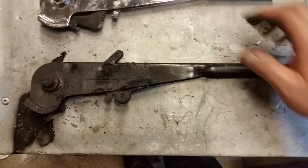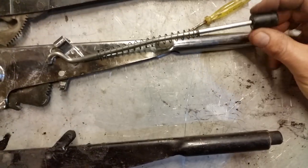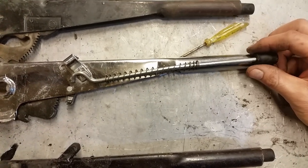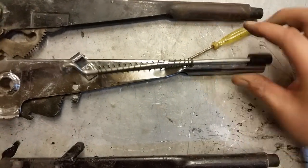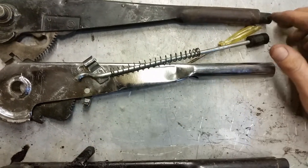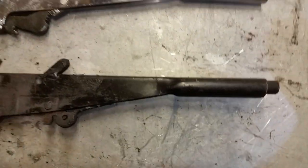They very kindly gave me the handbrake — you can see the stupid thing is worn off. So I was trying to show you how it works. On a repro one or a standard handbrake you've got your pawl, and it sits inside here. Obviously you press the button which pulls the pawl away from the teeth, releases the handbrake, and then the spring pushes it back which locks the handbrake — and that's how it works. What we've effectively done on this one is reverse that.